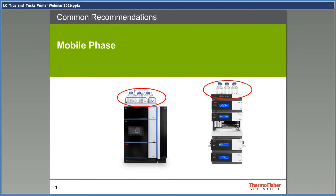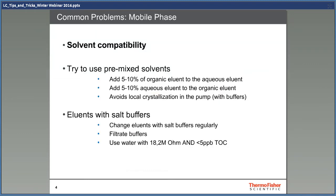First, we're going to talk a bit about the mobile phase. This is usually a forgotten part of the system, and a lot of problems can come from the solvents. There are a few things to remember if the analysis should be as successful as possible. To get the instrument to really work as well as possible, you should have solvents premixed with some part of organic in the aqueous solvent, and a bit of water in the organic solvent, to make it easier for the pump to mix. This is especially important for acetonitrile solvents.